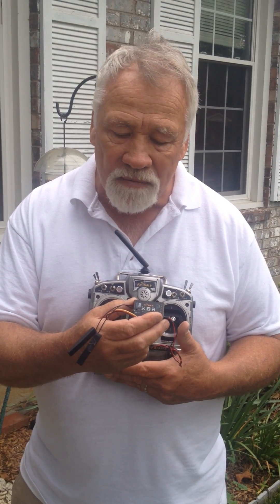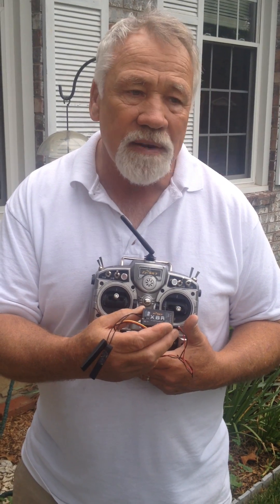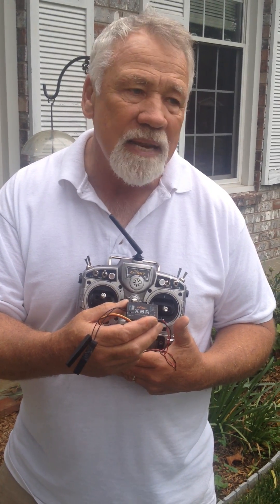When I walk away, it's only going to be about 10 to 15 feet. I'm going to put my back to it so I have the least possible signal. I'll cover one antenna and listen to the RSSI numbers, then cover the other one. With this particular receiver, you'll hear it drop quite a bit — from the 80s down to the 60s, maybe less.